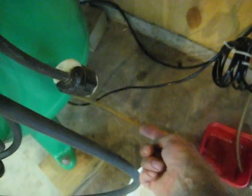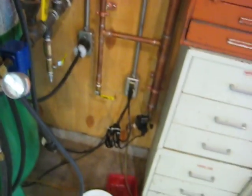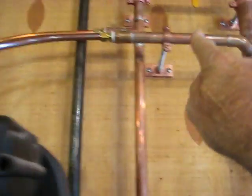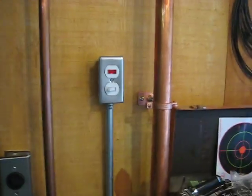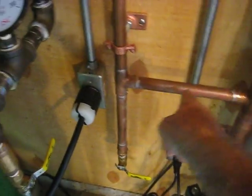I also have these electric dumps — you can see down here. There's one underneath this tank and it electrically dumps the water into that little container there. What happens is we come right out of the head here, go up into this big plenum, and it allows the air to expand and hopefully drop some moisture out at the bottom.